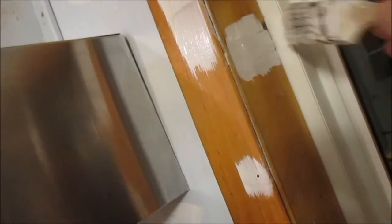Just wherever there's a knot, take some of this. It's hard to tell which are knots and which are just holes — here's a big one though. People think if you just prime over it then it should be fine, but I've been in so many places where they didn't coat the knots and they just bled through and it looks awful. So very, very important.